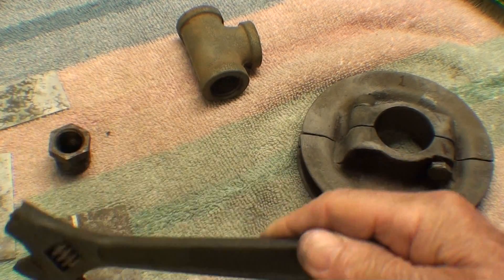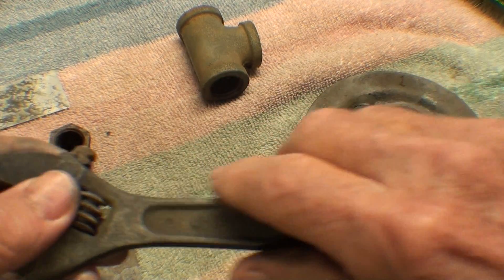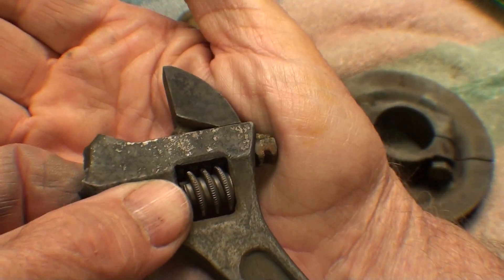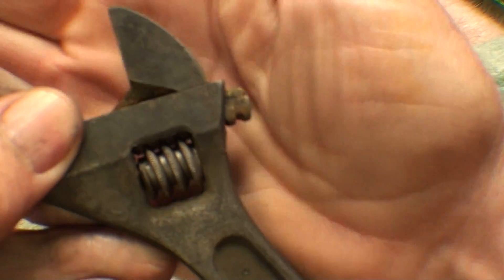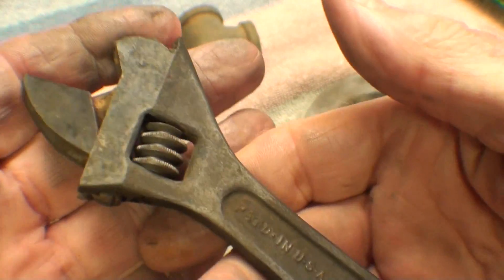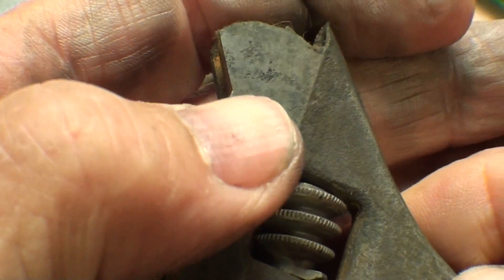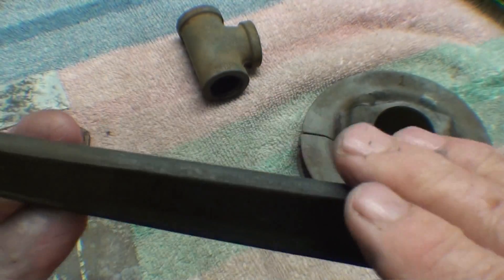So let's take a look at the old Williams wrench here. It feels rough — very, very rough, almost like fine sandpaper — especially down in here, and that would have been a polished surface. I know you're not going to be able to see any pitting, but the base metal here was definitely attacked. The knurl nut was obviously made of some other metal than the body of the wrench, because it's rather bright in appearance. It just has a rough feel to it, and very rough here — and you know these wrenches were smooth in this area.